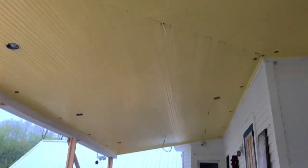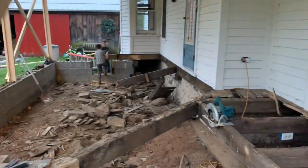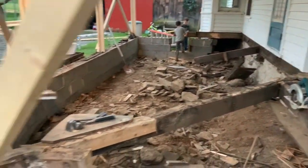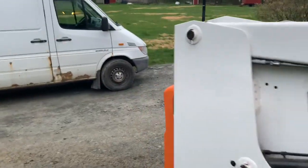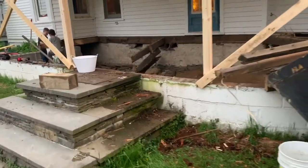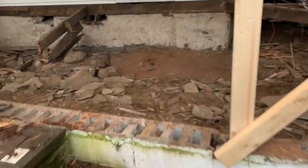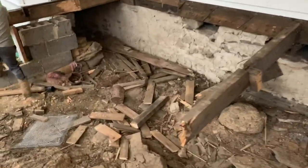The porch is all painted underneath, so all the paint's already been applied to the old boards — I don't have to worry about protecting the new concrete or putting down drop cloths. Next we'll clean out all these scrap boards so there's no organic material left in here to rot, shuffle these rocks around, and go ahead and put some modified stone in here.